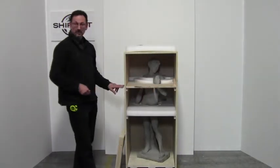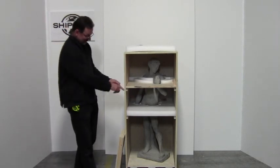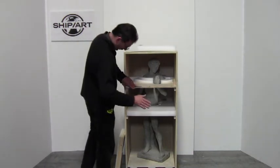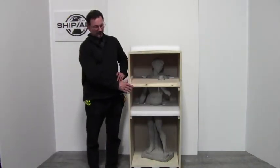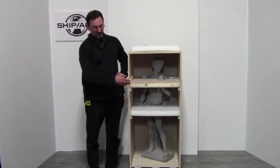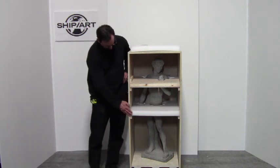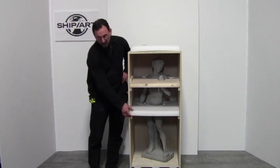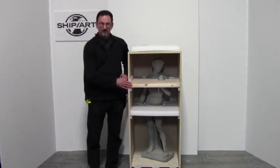You can, if you want to, go ahead and attach the front ones as well. You just need to make sure people know it's removable. Obviously, you need to do a circle or whatever kind of key you want to use. So those are the variations that I'm most familiar with using for contour packing, especially in crates. It varies from the lightweight foam, which normally you'd be using a 2.2 pound, I normally wouldn't do it with a lighter foam, up to plywood, and then finally up to a box beam style.